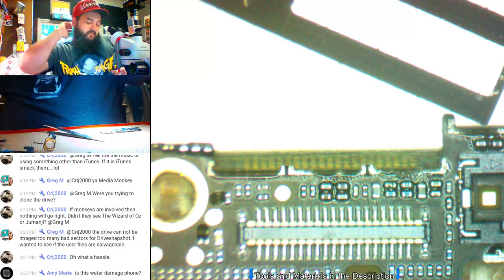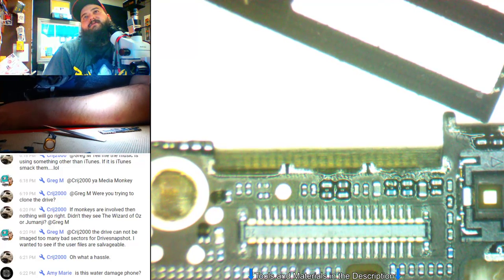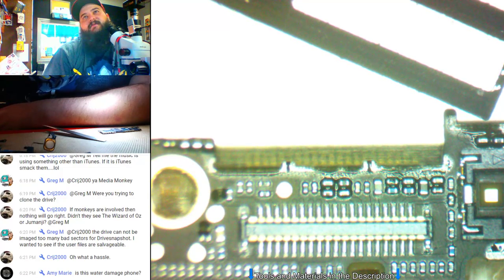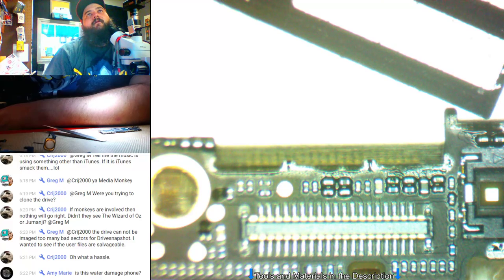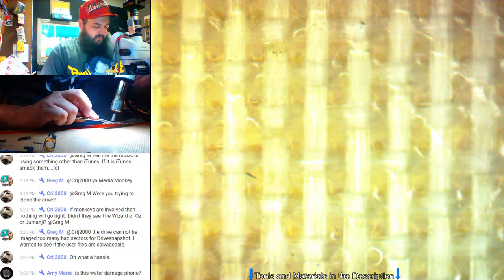Just tell him that they're not the same microphone setup. So it's got an AP by TriStar USB negative and positive line that go to the CPU. And we can test those resistors. That'd be the only thing that we could really test other than replacing TriStar, which we've already done. So let's pull a CPU shield and test these resistors for the proper resistance.